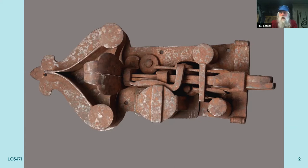This style would be on the inside of an exterior door, with all the parts exposed to the inside of the building. The bolts on the inside would be drawn back by hand after separating the tumblers by hand. When a lock has a pin in the center of the ward box over which the key has to fit, you can only enter that ward box from one side — the outside.